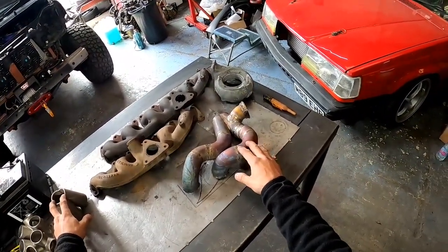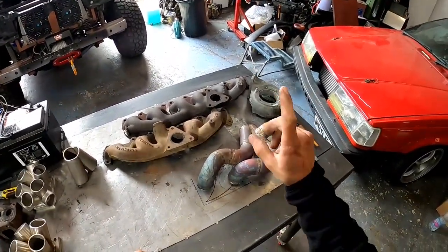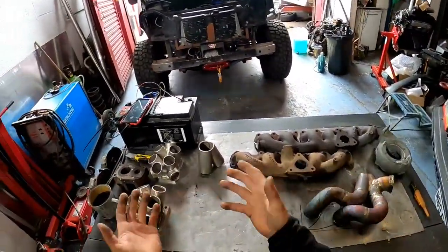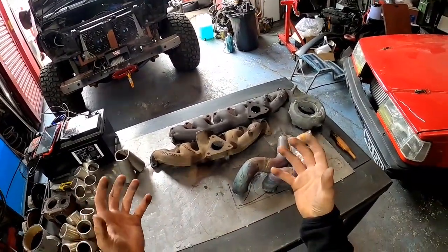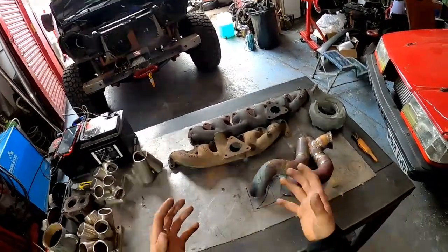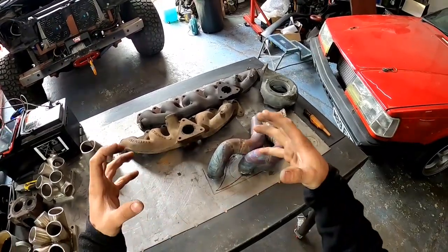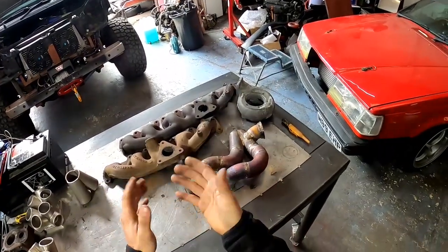No, it's not, because what you want is your exhaust gases to be as hot as possible when they go inside the turbo. Why? Because the hotter the gases, the more volume of it. This is the reverse ideology that you use for the intake. It is very well known that you put an intercooler or charge cooler and cool down the air before going inside the engine, because the colder the air, the denser the air, okay? And in a smaller amount you have more particles of oxygen, of air.